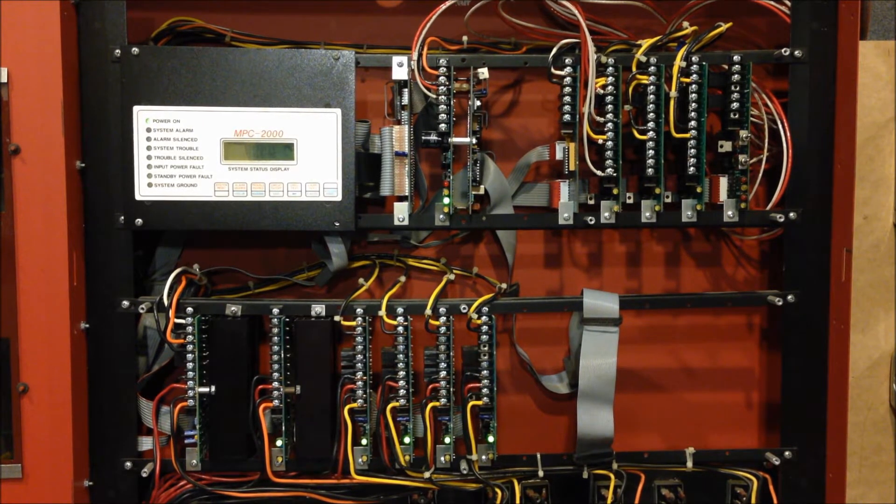The short facts about this panel: there's the main CPU board and then one addressable channel that can support up to 198 devices. There are six different notification appliance circuits spread across three SC2 modules. There is one auxiliary relay card that provides activation of two distinct relays on that module, which you can set up to activate however you want in the programming. Down in the second row, there are a total of six power supplies — or five if you don't count the battery charger. One of those is the main power supply for the CPU and addressable card; the rest feed into the NAC circuits and the auxiliary relay. It's powered by three transformers, each outputting around six amps, so there's a lot of power going into this unit. It is currently charging two 18 amp-hour 12-volt SLA batteries.